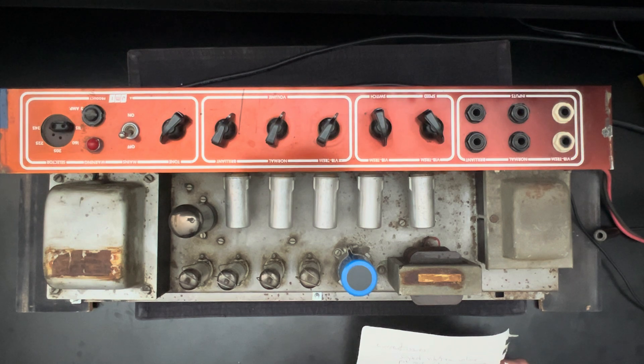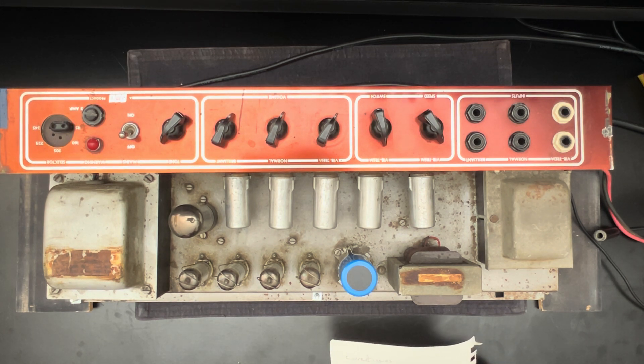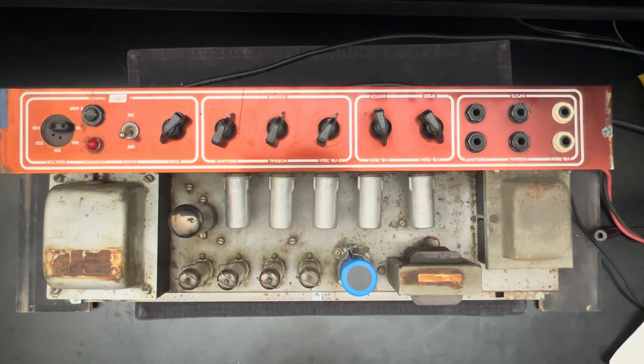And I think we should make that happen. He's got some issues. He suspects the vibe/trim volume pot has an issue because tapping on it or bumping it can instigate that issue and make it jump to full volume. There's some hum, perhaps a bum tube. I'm looking at an old set of Joint Army Navy Phillips from ARS. Back when these guys were slapping the silkscreen on tubes up in Van Nuys, California, Paul got himself a quad of 6BQ5s. Hopefully they haven't barbecued. The goal: he wants it to be fully healthy and stable and ready for decades to come.